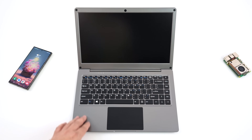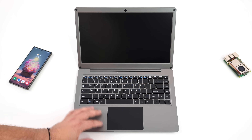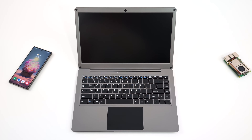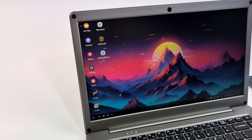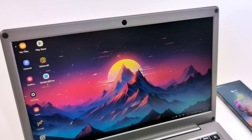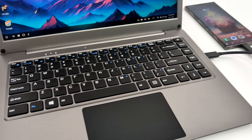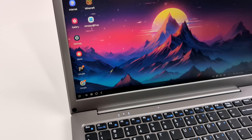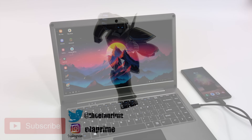Overall, I think it's a pretty nice little setup. There are a few things I'd love to see changed in the next revision — obviously we're going to need a bigger battery. The 5000 mAh battery does five volts, five amps out, and we could charge a phone or run the Pi for a while, but it's not going to last all day if a device like the Pi is also drawing from that battery along with the LCD screen, keyboard, and trackpad. Another thing I'd love to see is a metal version — they kept costs down by using plastic, but a more premium feel would be really awesome. Either way, it does work as intended and we can connect a ton of different devices. As long as that device supports HDMI out or video over USB Type-C, it's going to work with the Crowview Note. I'll leave some links to their official website down below, and as always, thanks for watching.